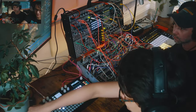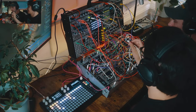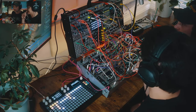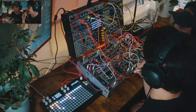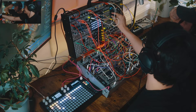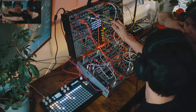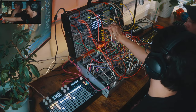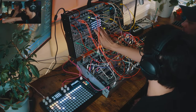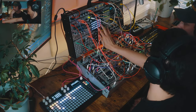So again, we'll do the same sort of trick, but this time, how do I want to do this? I want to generate a slow clock somewhere. Where do I have a slower clock? Here's what I do. You could just use one of the channels from here. Yeah, exactly. So we'll take our channel 3 and make it a square, and then we take it and we slow it down.